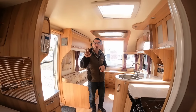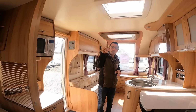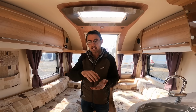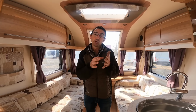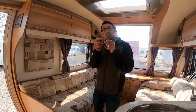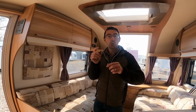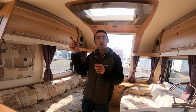Two customers have come up against issues this week. So, cassette toilets. Popping up now is the little fix video if your toilet cassette isn't working. But what that didn't cover is the little plug. Sometimes there's a little plug that goes onto the little PCB board, the flush button board at the top, and it's actually the connections into that plug that are the issue. Instead of having to buy a complete new wiring harness, you can buy just the little plugs and rewire those in. So popping up now is the video of that happening.